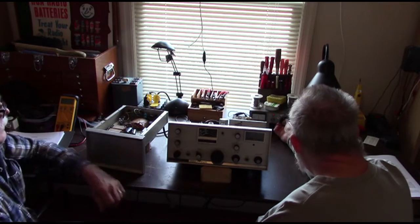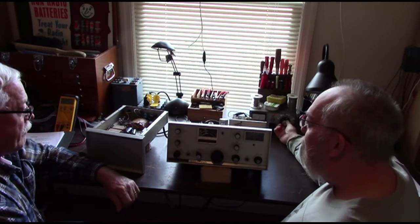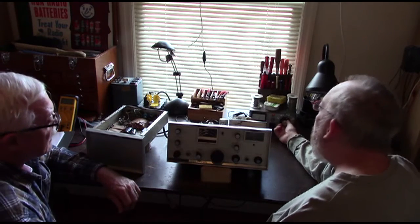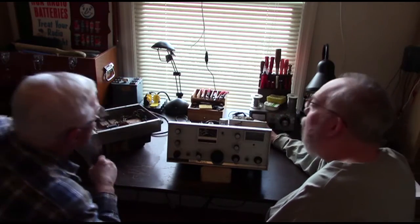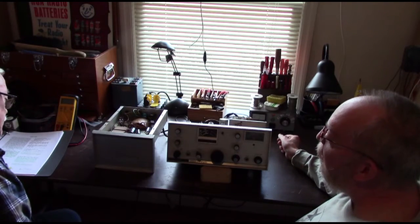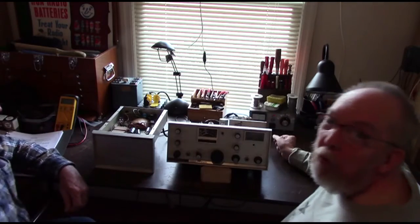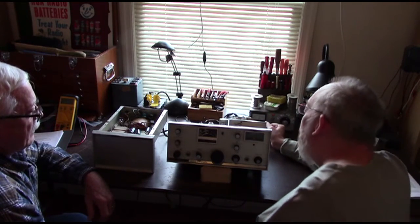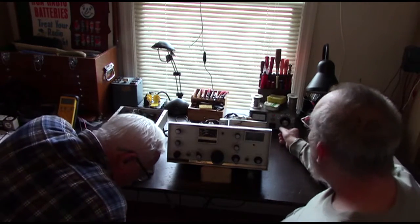All right, let's move it on up to 90 — we might get some sound now. With all my AM broadcast radios I've done, usually about the time I hit 90 volts I start hearing some sound, even if it's just hum. Do we have the speaker plugged in? I believe we do. The actual speaker — yeah, it goes into the Jones connector, tied in that way. I just want to make sure we aren't sitting here looking dumb. We have noise! We sure do — you probably won't hear it but we can hear it. Still no smoke, still no fire, no sparks. And we've got some filament glow on at least some of these tubes. I think maybe we're cooking with gas.